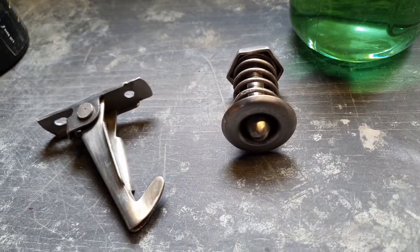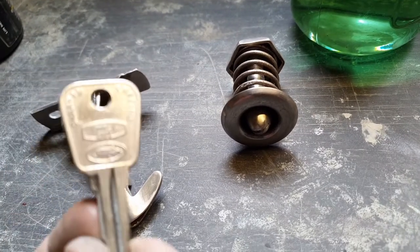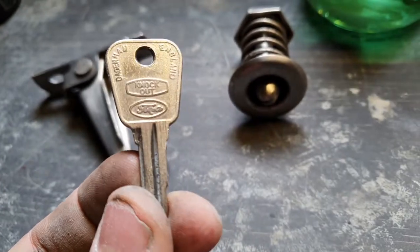You can basically do anything that's made of steel, and I've even managed to do the original key — there you go. Overall I'm happy with it. Definitely got a lot more to learn myself. You can do other metals like zinc — I know you need to nickel plate before you can copper plate. If you have got any copper, you can make this solution up in the same way; apparently copper turns blue and zinc stays fairly clear from the research I've done. It's something I might try in the future. If you've got any questions please ask — I'll answer them as best I can. I hope it goes well for you, just let me know how it gets on. Thanks, see you soon.